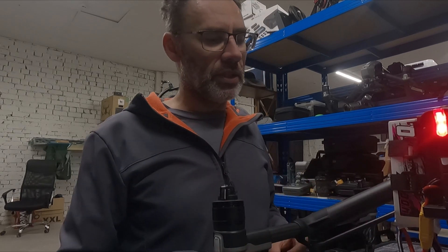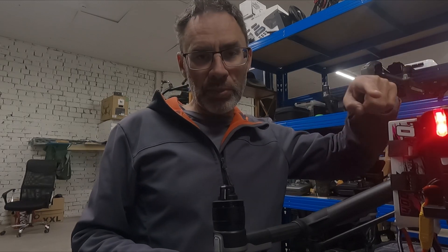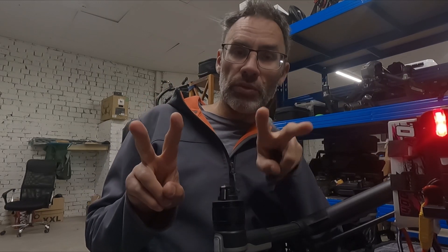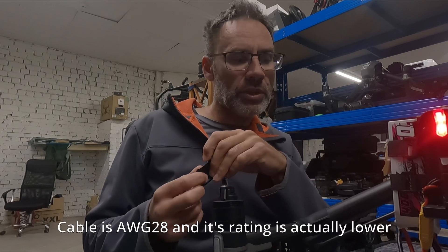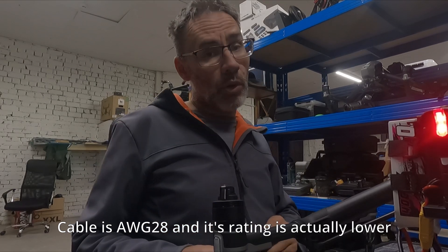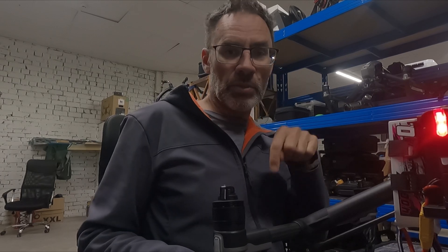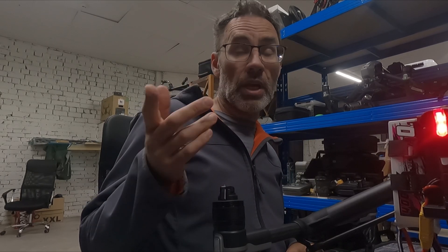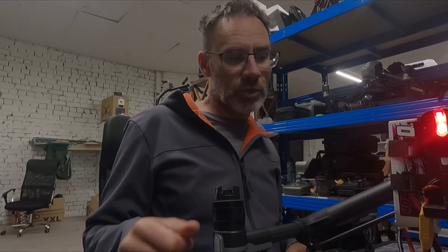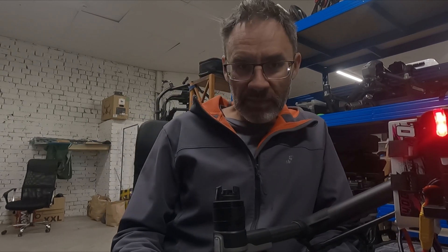You should put the cover back on, but generally speaking it's easy. Each pin is rated one amp and there are two positive and two negatives coming out, so you get about two amps of unregulated power from there. If anyone knows why we shouldn't use these ports, I'd be glad to hear in the comments. In the description there's also a link to our group — join if you have something interesting to contribute. Chris, thanks again. Bye everyone!